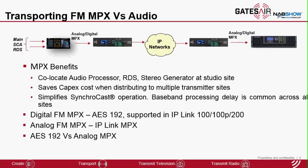Analog MPX required new hardware support and therefore the introduction of IP-Link MPX. With this introduction, we round out our capability of distributing FM composite signal. As far as selecting between AES 192 and the analog MPX mode, if your exciter supports AES 192 interface and there is sufficient STL capacity available, AES 192 is the way to go because it provides better signal quality due to the all-digital path.